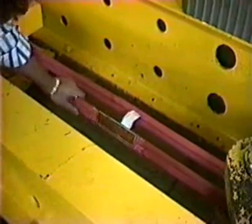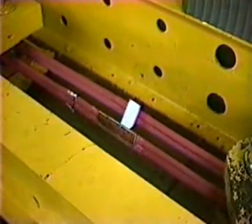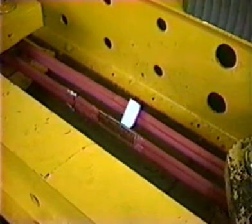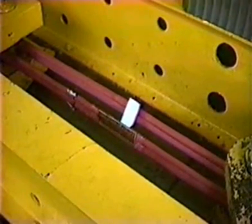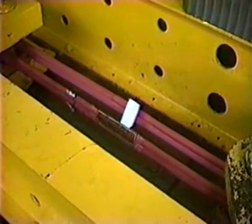This particular sling has been preconditioned to 40,000 pounds vertical, which is twice rated capacity. We're going to go ahead now and pull it to vertical destruction. I'll try and zoom in on the tattletales to show you what's going on as we approach the break strength. We're expecting to obtain about 100,000 pound test strength on this particular model.